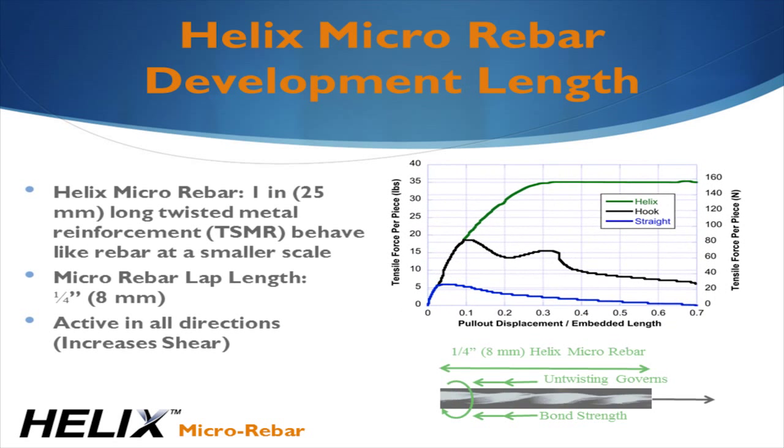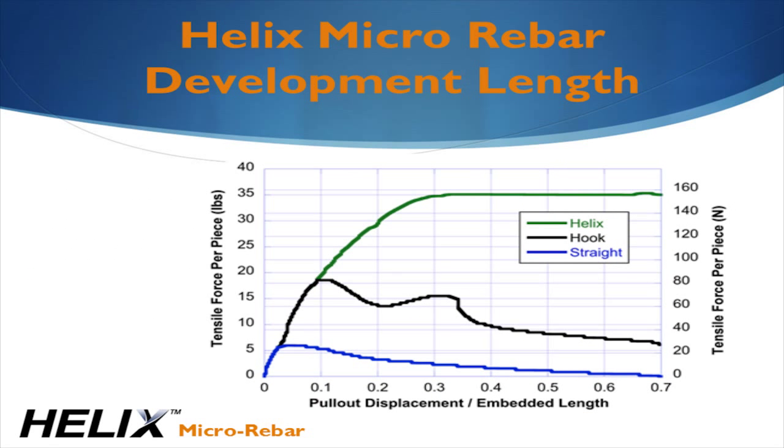People have been trying to do this with concrete for centuries. The problem is the behavior of anything you mix into the concrete is fundamentally governed by friction. Friction is just a function of how much surface contact there is between the reinforcing element and the concrete. The blue curve shows the instability that occurs with frictional bonds. This case is a straight fiber with increasing strain.